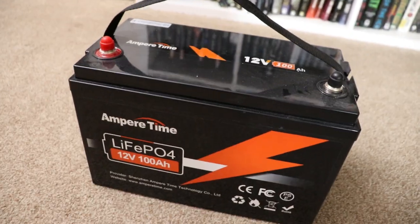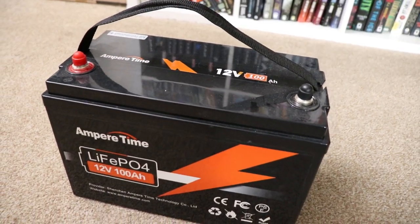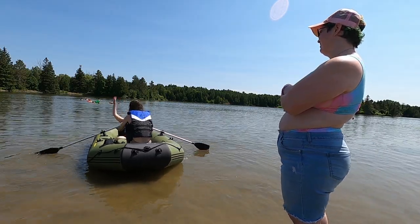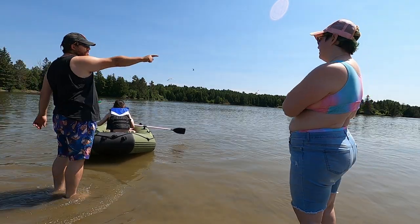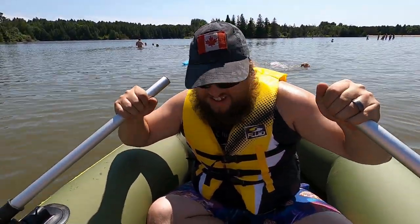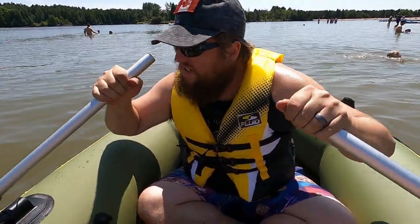The autonomous navigation parts come later this summer. Total battery capacity will be 2.4 kilowatt-hours of lithium iron phosphate batteries — two batteries I'll cycle back and forth. While one runs the boat, the other will be actively charged by 240 watts of solar deployed in the boat while navigating. The whole setup will go anywhere from 5 to 8 kilometers per hour, so covering a 50-kilometer leg will take basically the entire day. If I add a second solar panel for 360 watts total, the motor only pulls 360 watts, so under perfect peak conditions I could power the motor entirely on solar. I also have backup paddles just in case.